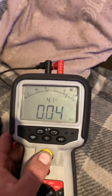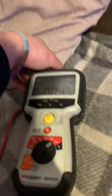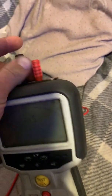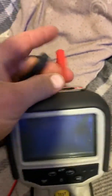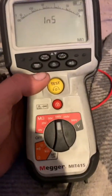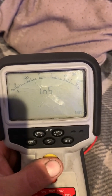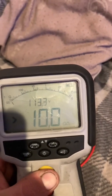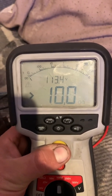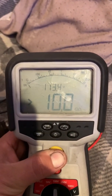This one's not making a noise - I have had them making a noise in the past. Something I did notice though, which might be interesting for you - something to watch out for. If you have no leads connected, so if you don't make a proper connection, in this instance you're on 100 volt setting and you press the button, the scale goes all the way over to the left but the voltage reading actually reads 113. Just something to bear in mind - watch that graph at the top when you're testing, just to make sure you are actually connected.